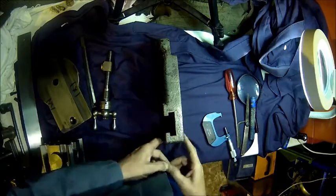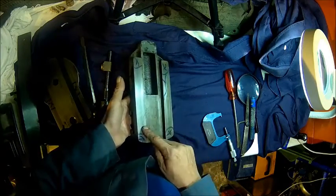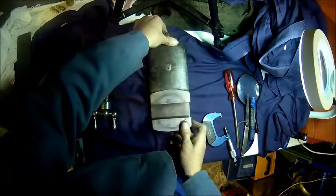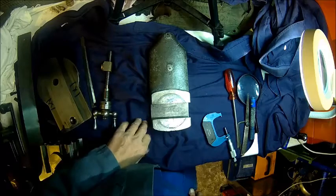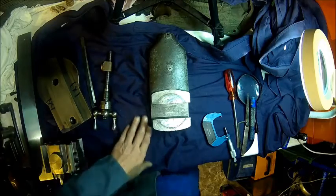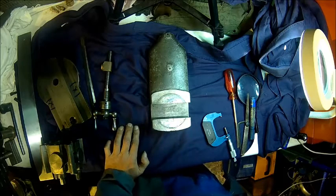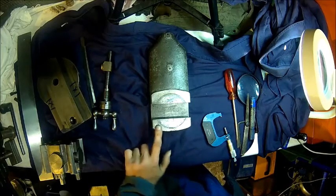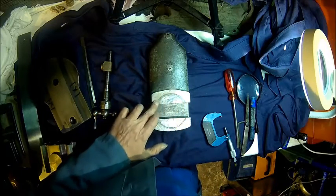We got a variation in thickness here, but we need to check the bottom surface first because that's going to be our reference surface. If that's fairly okay, we just leave it alone, and then we're gonna machine that somehow. We know it's fairly flat on the surface because the distances are within a couple of hundredths of a millimeter. It's mainly getting rid of the dents and nicks and make that flat, and then we should be good to go. Hoping that our chatter is gone then.